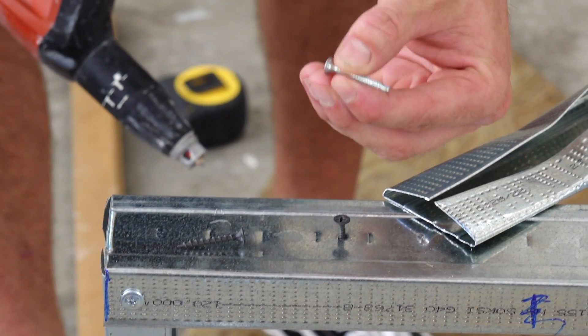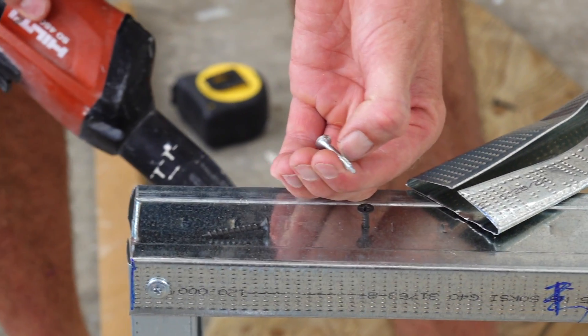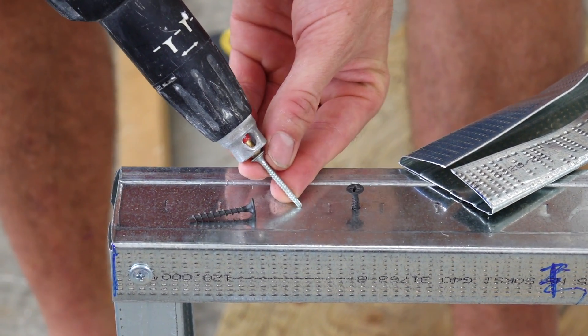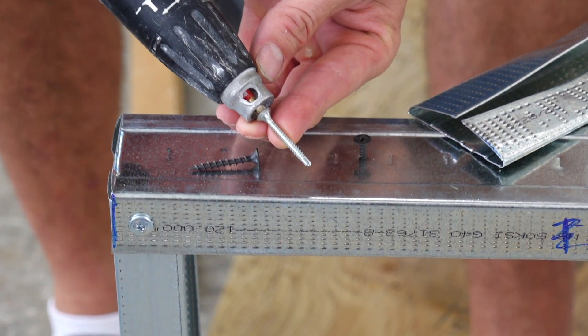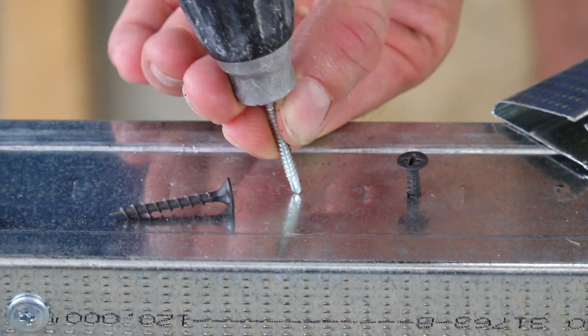Next we have the self-tapping one, which might cause me a bit of grief as I try and sink it, as it usually does better with a half-inch of drywall supporting its edge as it's being driven. This one is actually designed for heavy gauge steel studs, so that's why it has the self-tapping bit — like a drill bit. If you guys can see right up close, it's like a little drill bit there. That's designed to go through thicker steel.